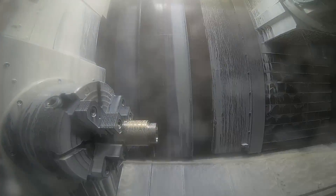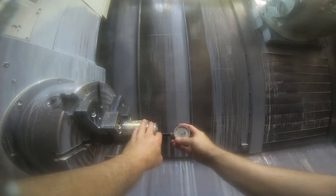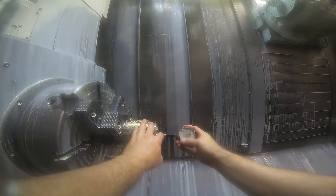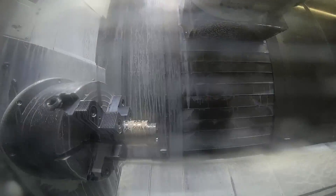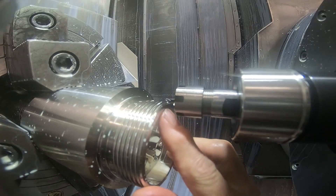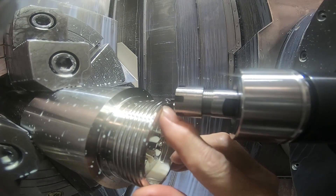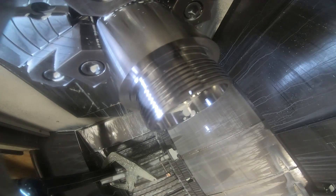Here's that form tool to form some steps in the counterbore. They've got a close tolerance on one of them in front of the gun drilled hole. I have to have that hole in there because when I gun drill, I'm at the end of the flutes of the gun drill. That just forms some little chamfers on the half inch hole. Here's the thread blunt start tool — the way this is specified on this part, you have to have a small radius on this blunt start, so I had to use a 3/32nd end mill. So that's what it looked like when it was done.